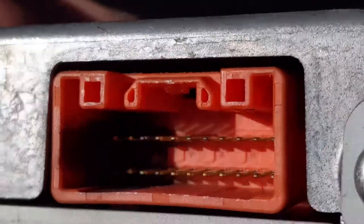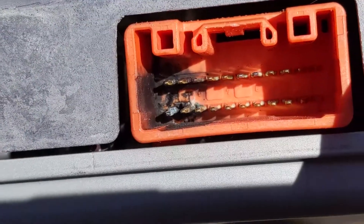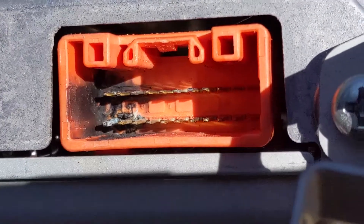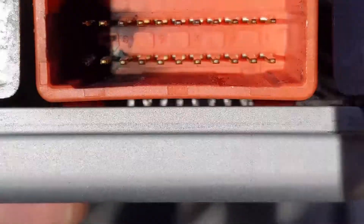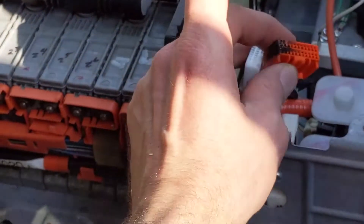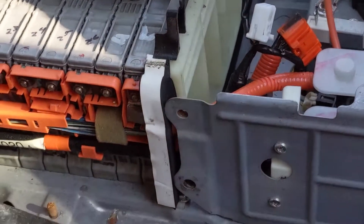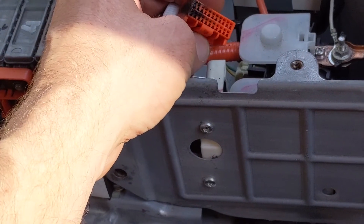Continuing to take this out to see what the battery ECU looks like. Opening it up — it's hard to see because it's so blackened in there, but I can pretty much guarantee this did not have a good connection. You can see the bottom left pin is very corroded and nasty. I'll need to research why this happened. The next step per the Toyota manual is to measure resistance between the pins on this connector and the metal connections.